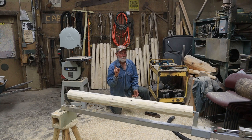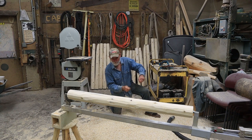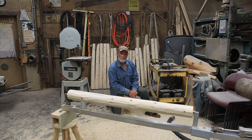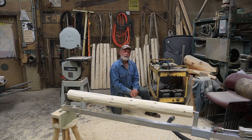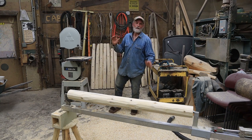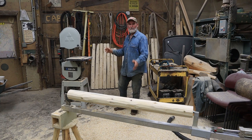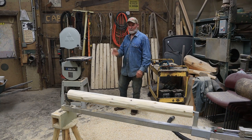But I tell you, this cedar, if you were to cut it with a draw knife, the grain is always changing. You got to work from one way, then work from the other way. Otherwise, you got chips and splits all over. So the planer is a much easier, cleaner, nicer way to go. And for myself, I like cutting everything to length first. Get it all in its finished length, and then plane it down and make it really nice.